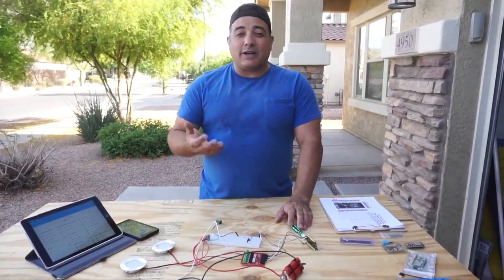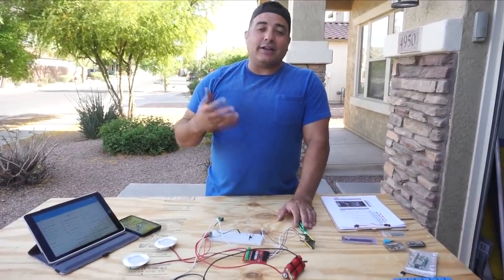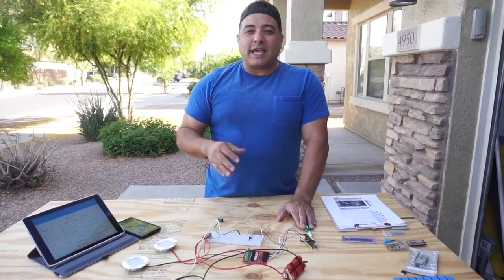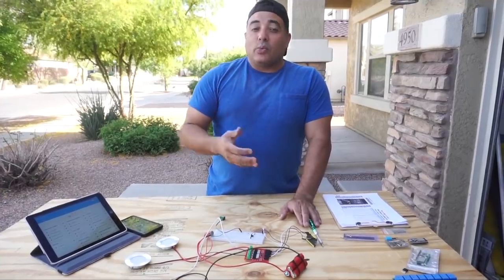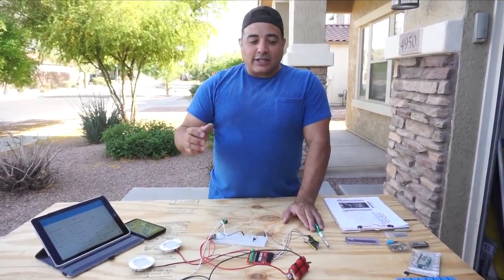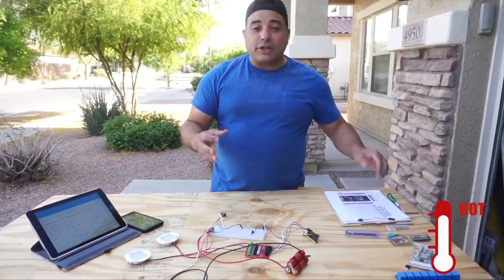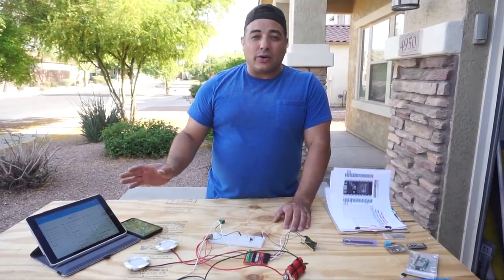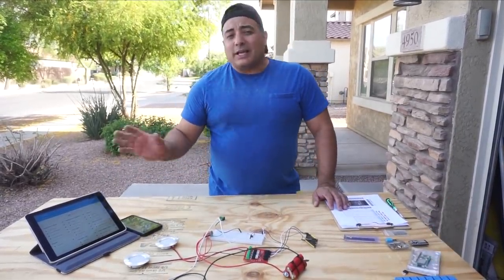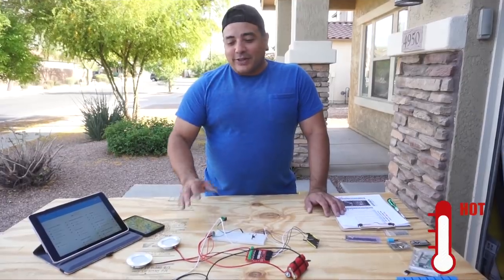Also, if there's a significant amount of network lag, if you push the switch, it may be a little while before the light actually turns on. And when you're pressing a hard switch, sometimes that can be a little unnerving. With a hardware switch, you can guarantee that as soon as you press that switch, within a couple milliseconds, that light's going to turn on. That responsive time, you can only guarantee if you can control the environment it's in, and you can really only do that if they're on the same processor. I can't control network latency or if the database is running slow or anything like that. But if it's on the same switching hardware, then I can definitely control that. So the response time is going to be much higher.